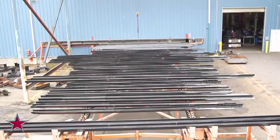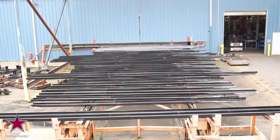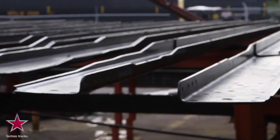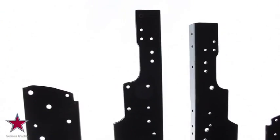You can see all the frame rails lined up outside, per serial number, ready to come in for assembly. You can tell by all the different lengths and thicknesses how many different trucks we can build here in one day. These frame rails are punched out — not drilled — by a computer diagram. Then they are flanged, then they are shot peened, and then they're e-coated.